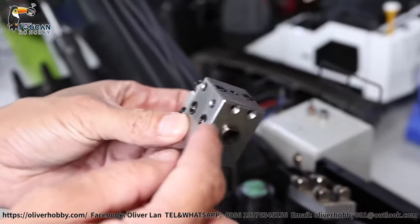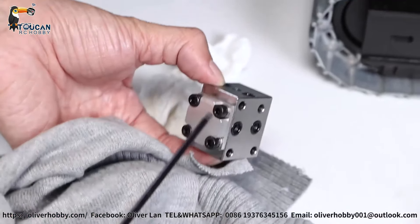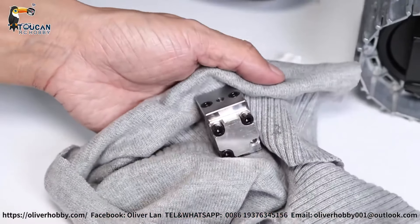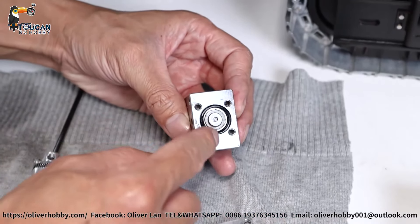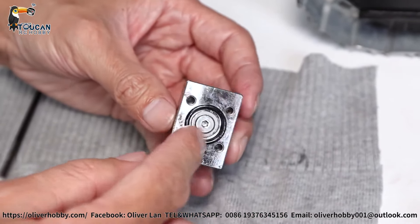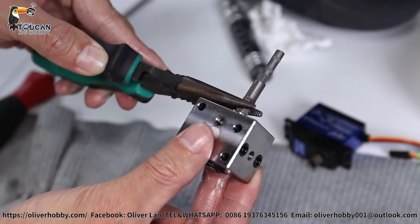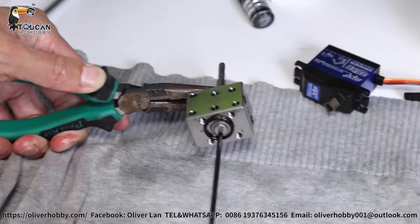So now I will open to see inside the valve. That's the top in and out. That's the servo shaft connection. Four screws removed, already loosening it. Then we can open the cover. Turn around, four screws removed, pull out. That's the cover seal. And here, middle curve piston — one more step to remove it, one more screw here. To stop the piston inside from turning freely, use the iron key. Then I can unscrew this screw and see inside the piston shape.